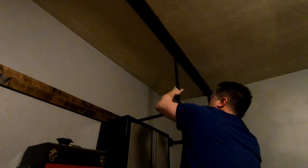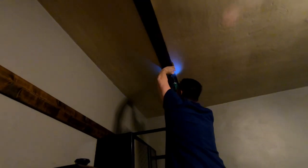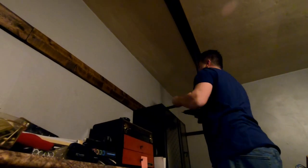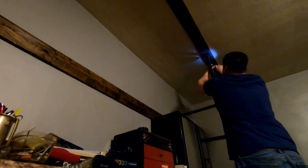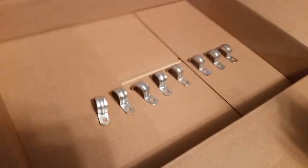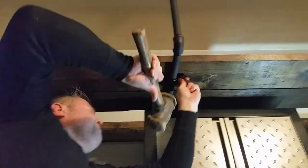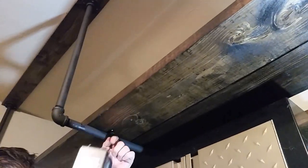At that point, I'm going to take the brackets. The brackets actually have to go into wood studs because there's going to be a lot of weight on this. I'm using a cordless drill with 3 to 3.5 inch deck screws that I'm putting into the wall and on the ceiling. I'm going to use my body weight — I'm approximately 200 pounds — and pull down to make sure it's going to stay. These are 3/4 inch EMT conduit straps, one-hole, and I'm spraying them in black to match. This is going to hold the shelf in place so it doesn't slide off. I'm using a mallet to tap it on, then a short deck screw to hold it in place.